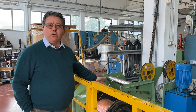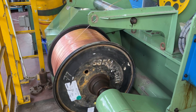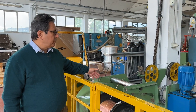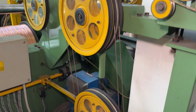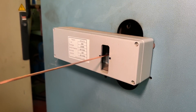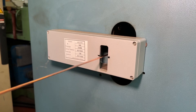Here is where it all begins. We've got a big spool — about 500 kilograms — and we are unrolling the solid core or the stranded core which is going to form the cable. In this case we are talking about the stranded core. You can see the core is passing several times in order to be straightened as much as possible. Then it's passing through here, where we have a laser gauge, and by means of the laser gauge we can check and record the actual size of the stranded core or the solid core.